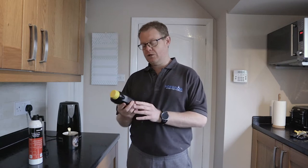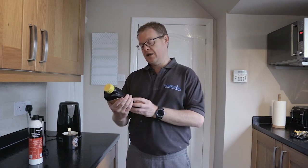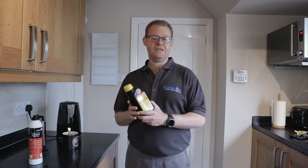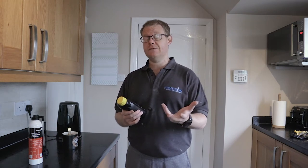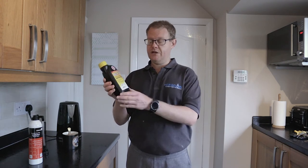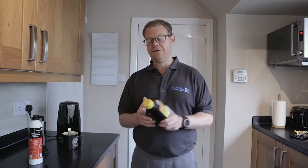So what we'll be talking about today is something called inhibitor. It's something I'm going to show you how to put into your heating system. Inhibitor can be used on a combination boiler or a tank fed system. So if you have got tanks in the loft and you've got a tank fed system, so that you've got stored up water, you want this version of it, just something you can tip into the header tank inside the loft. Very easy to put inside it on a tank fed system.